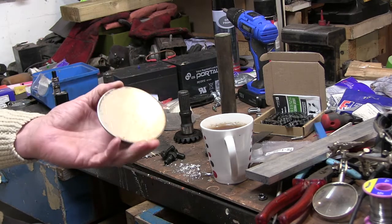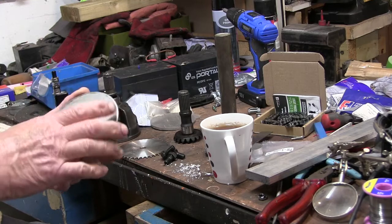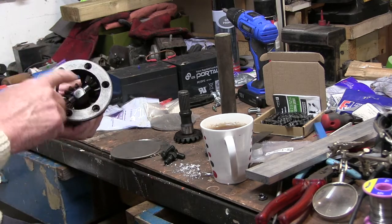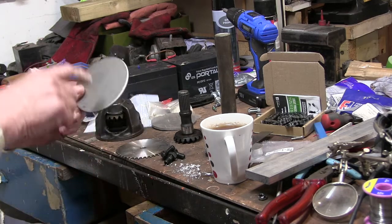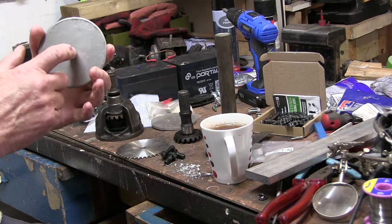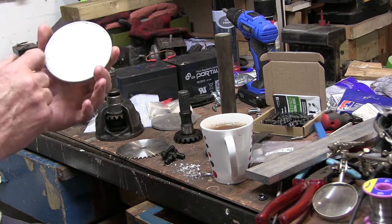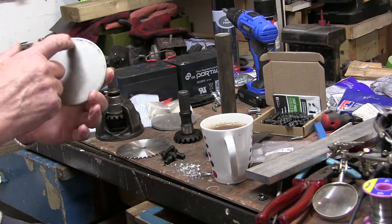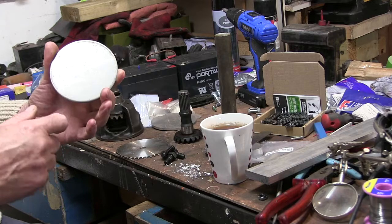So I'm just gonna put the outside jaws in my lathe, mark the centre. The diameter of the bolt holes, as near as I can measure it, is 85mm. So when I get it in the lathe, I'll spot the middle of this, do the 85mm diameter circle on here, then bore this out and then mark this up to punch to drill the holes for the bolt holes.